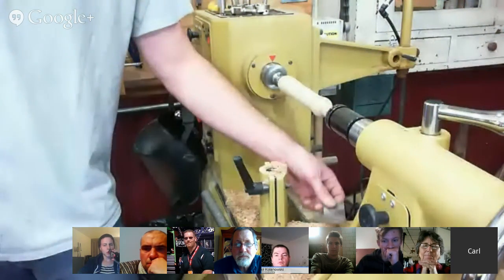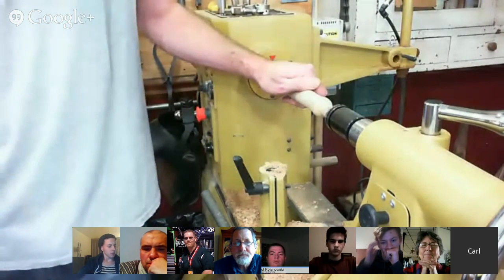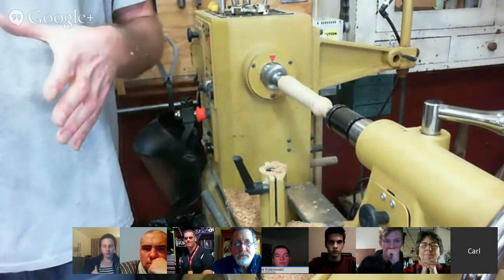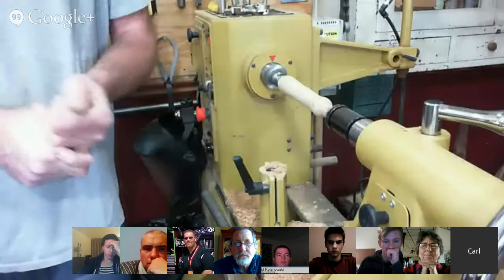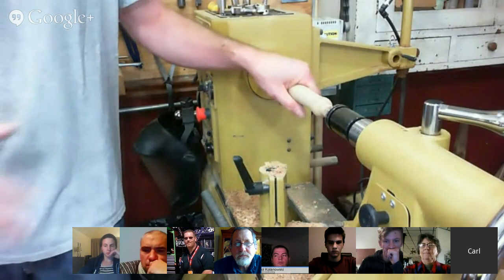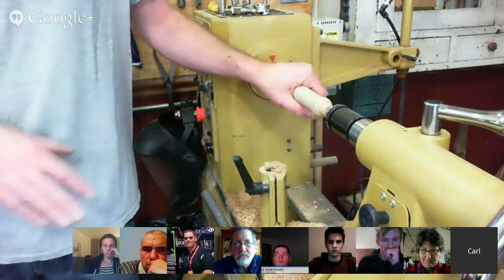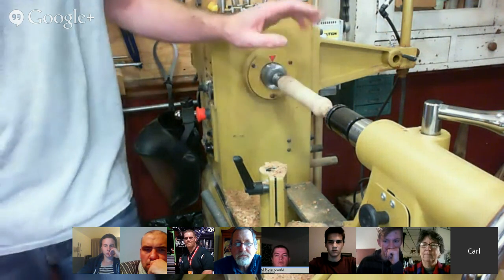I had a question about the sun I did for Friday's project and why I didn't use wax. It's because of all the little curves in it. If you fill that with wax, it's going to turn white and it's going to be a pain to get all that out. So I just put a coat of salad bowl oil on it, and that way you don't have to worry about it. It gives it a nice sheen and the wax won't dry down in those cracks.